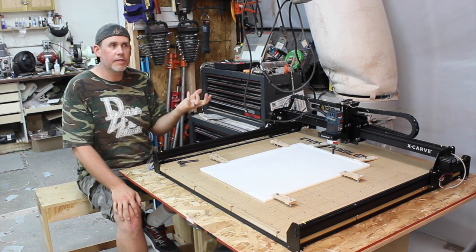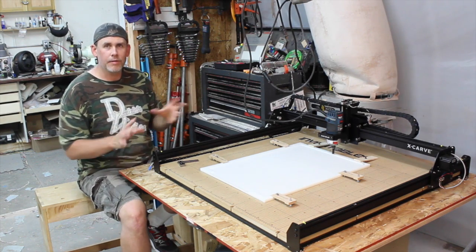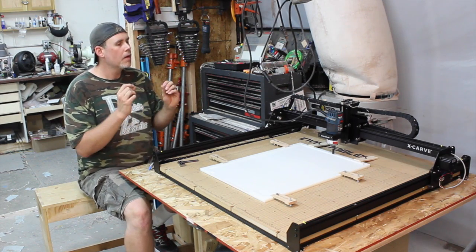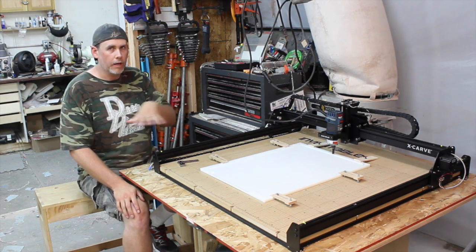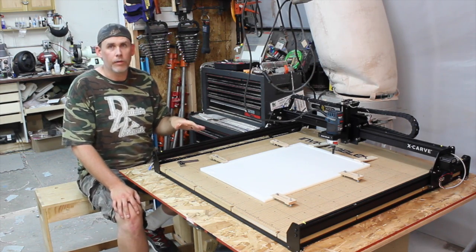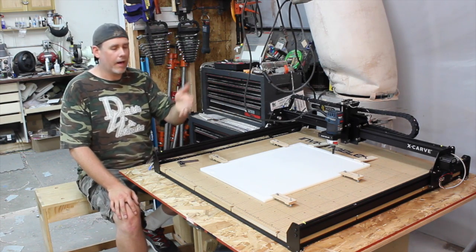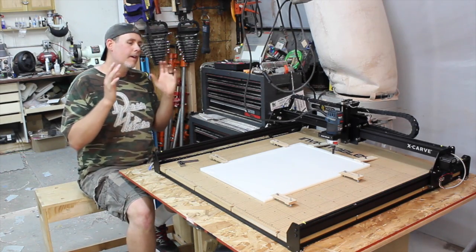I had the original settings, which I think are the defaults for HDPE. I may have changed something there. I can't be certain that it's the default that they give you. But it was running at 15 inches per minute feed rate and like 0.02 depth per pass or something like that. It was really low, and it was going to probably take 8 hours with those settings, and literally I started so late that I had to just shut it off because I had to take my computer on again. So I had to redo it.